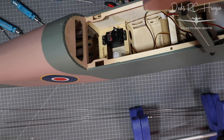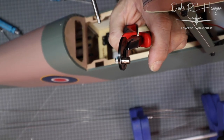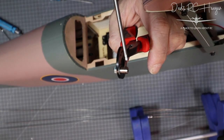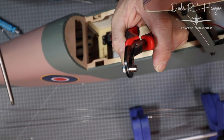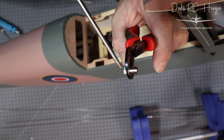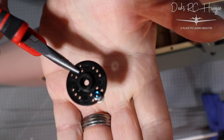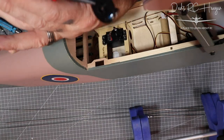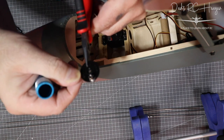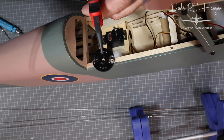Just before I put it all away - these are in the manual. I'm not sure what the name of these parts are, but they hold the push rod. Then we've got the washer and then a nut. What I've done is put some blue Loctite - if you can see that - and I put it to the edge. You get like three or six holes at either end. I drilled a hole with a 2.1 millimeter drill bit.